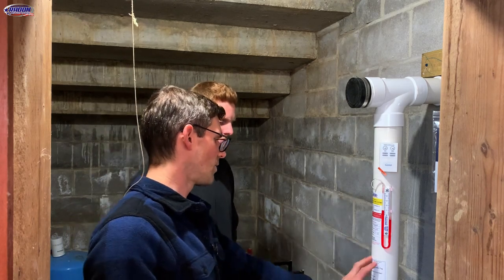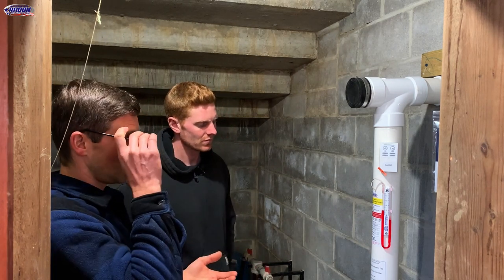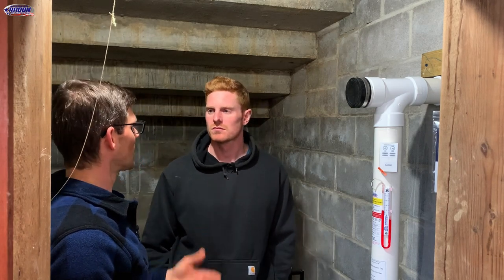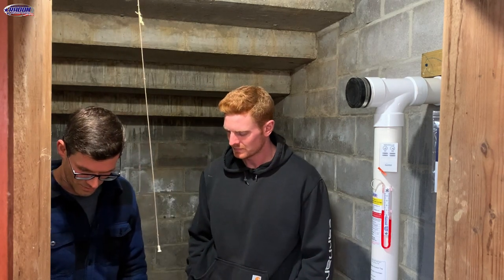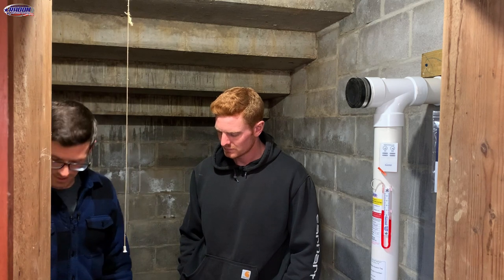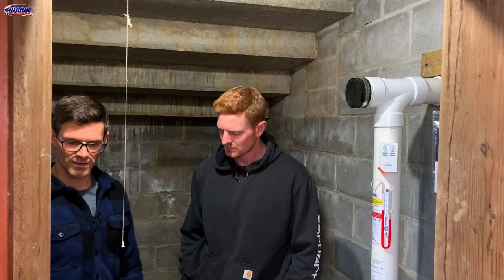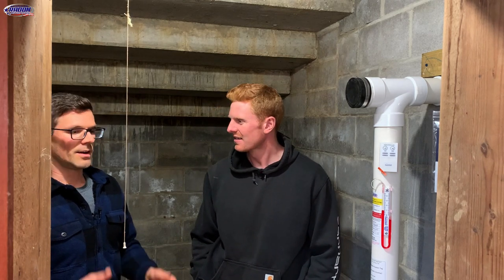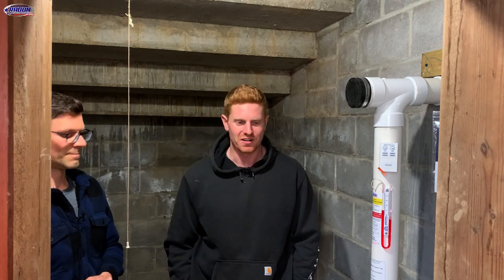If it changes substantially, just give me a call and let me know and we can come out and troubleshoot it. Here's my information and here we've got your system tag — the Department of Health may reach out to you and say they saw Jesse put a system in and ask if they can come out and do an inspection; you can say yes or no. Coming over to the sump, you do have a new cover on there — I used a used cover to save you some money. I've got an access port in there and a water alarm, so when that sump fails, you'll know before it floods.